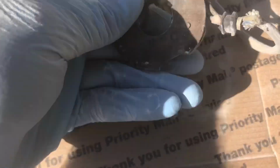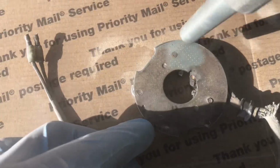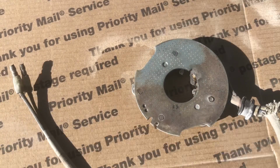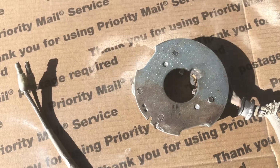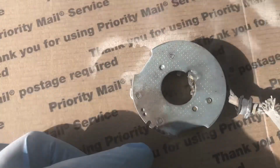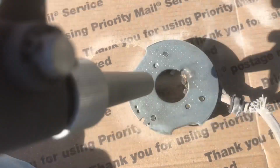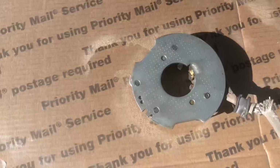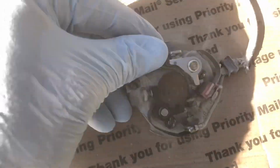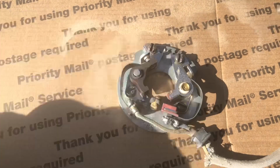The one thing I like about soda blasting is that it's very fine, so it doesn't harm chrome, and it's a dry cleaning method. Baking soda is also very inexpensive, and you can buy it at any grocery store. With this blasting gun, it's nice because it's portable and you could use it in your backyard. You can also use sand as the media to pull rust and paint off of surfaces.